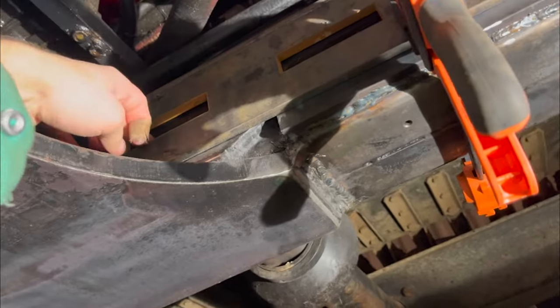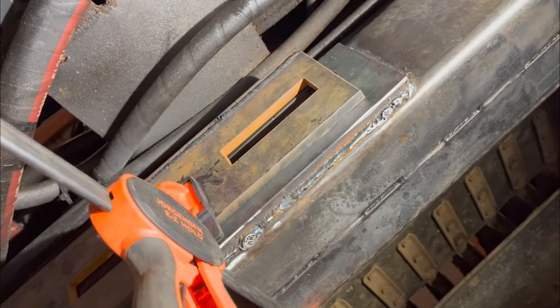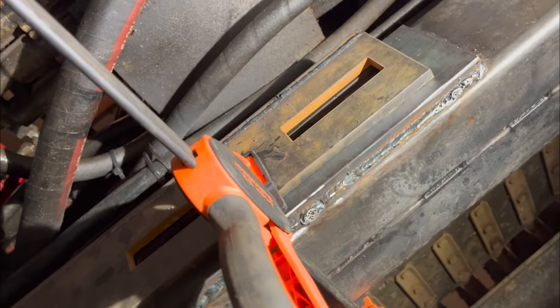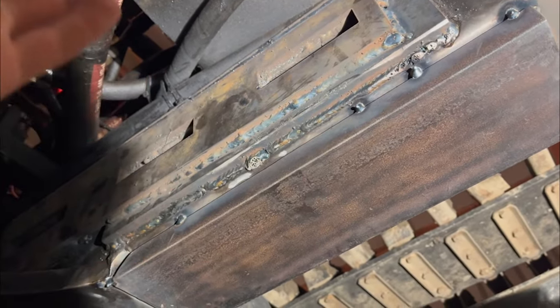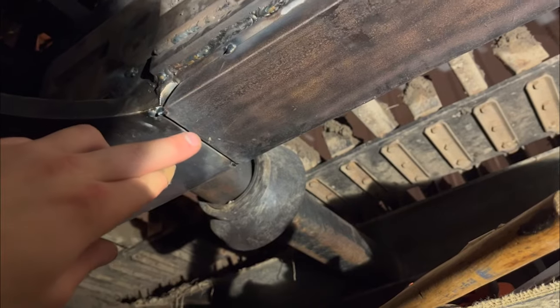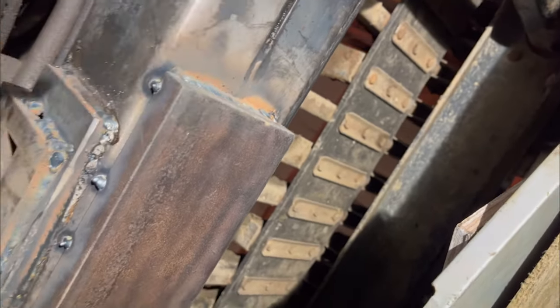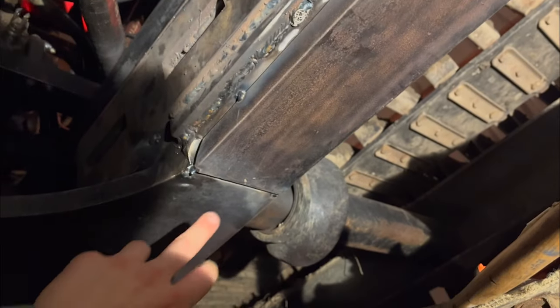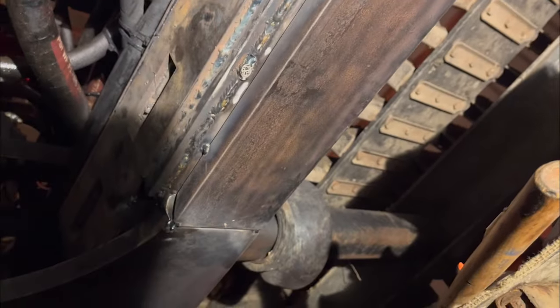You can see the top piece welded on right to the frame — so it can't flex very much. This piece of three-eighths I'm about to burn in. We've got our top plate burnt in and everything up there is done. Me and Austin just clamped up this one-inch and tacked it in. We're laying a pass there — going to do multi-pass because this is some thick stuff. Going one-inch to one-inch and one-inch to three-sixteenths. We're going to get this welded in and then put one more three-eighths strap across this, and the repair will be done.